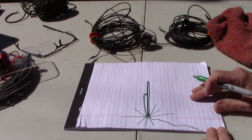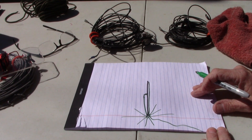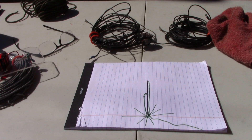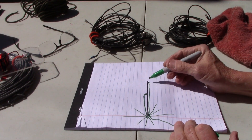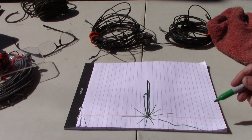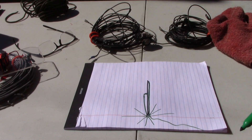And if it looks a lot like the DX Commander — well yeah, it kind of is. It's kind of a homebrew version of what his is, but I've never run it over two elements, basically because we were in the low spot of the solar cycle. I used it extensively up on 40 and it did great — it tuned up well and made really good contacts. So a basic vertical — it works great.